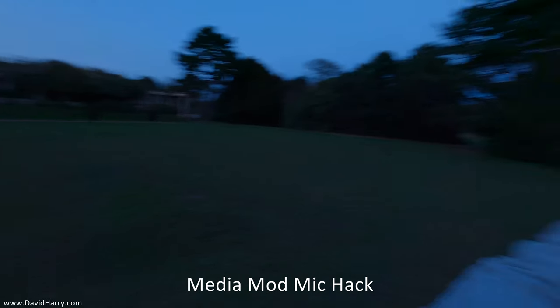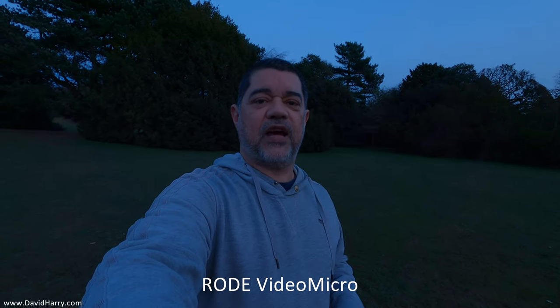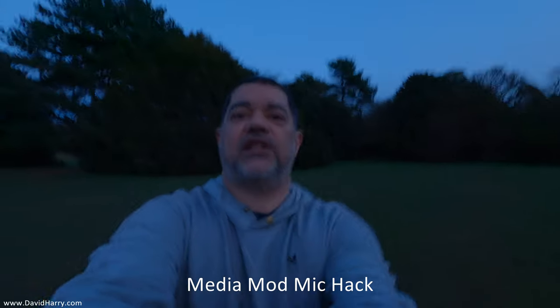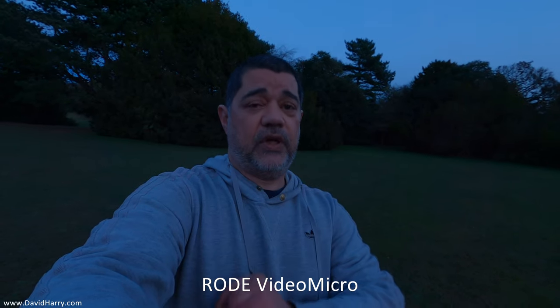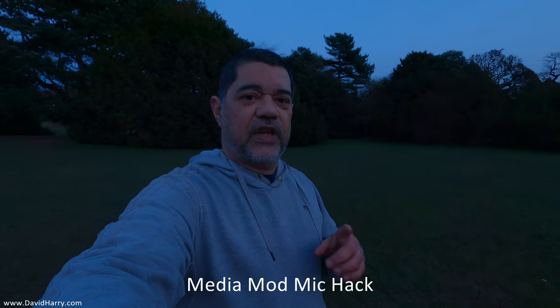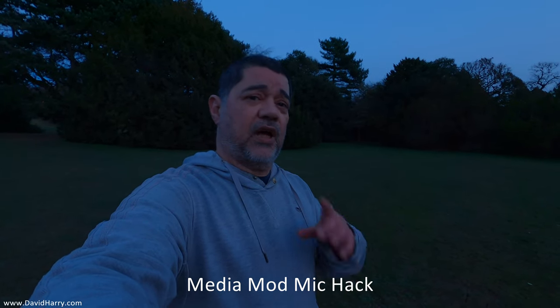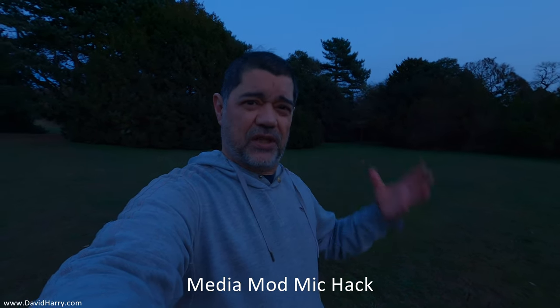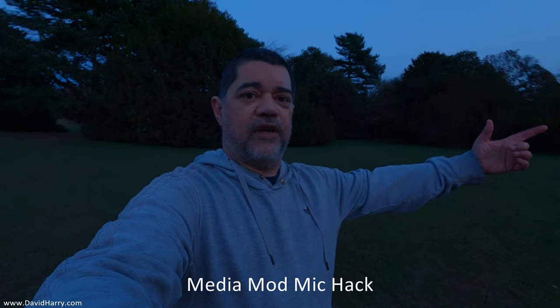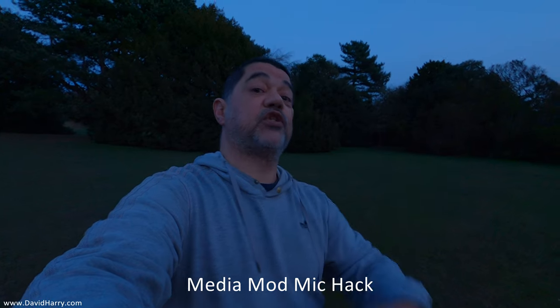Now turning back to the front. A quick handling test: I'll switch to the internal mic and roughly handle the GoPro handle — we're definitely going to hear this. Now switching to the Rode Video Micro for the same handling test. What we should have distinctly heard is that my modification is much worse for handling noise, only because there's no acoustic isolation in this build — no suspension of the capsule as there is with the rubber shock mounts on the Rode Video Micro. Then pointing away for a silence test, alternating between the two.